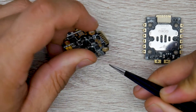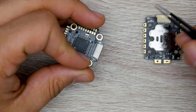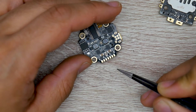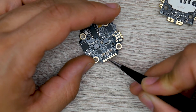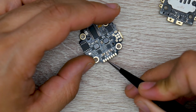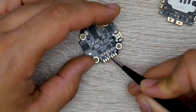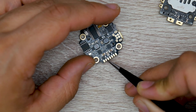On the bottom, under the connector, there are broken-out pads that are completely separate from the connector connections. Here we have: ground, 5 volt, and the LED data signal pin. For an RGB LED — typically three wires — ground goes to the black pad, red to 5 volt, and signal to the LED pad. For the buzzer: buzzer minus goes to the fourth pad, and buzzer positive takes 5 volt from the second pad from the left.